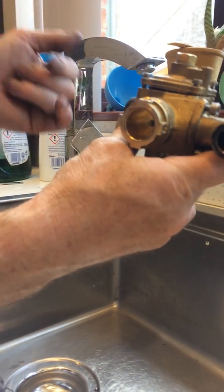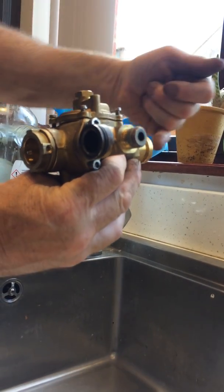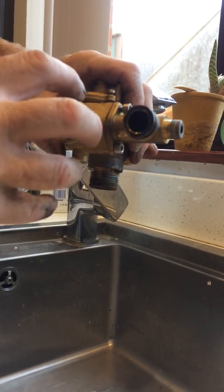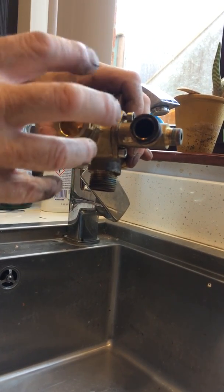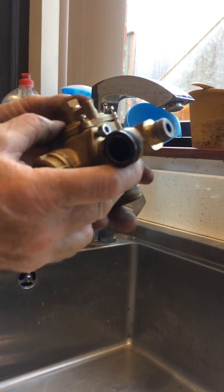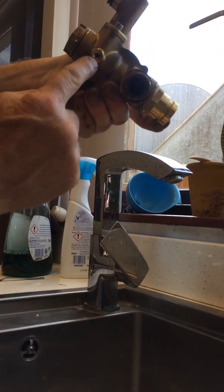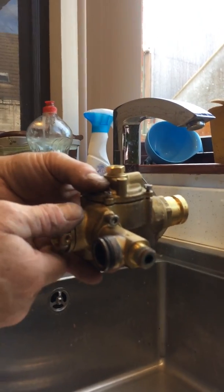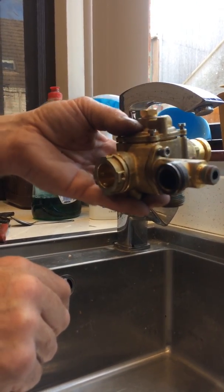The flow pipe from the water goes in here; I think this is the bypass pipe into the rear section — it just pulls out and a clip goes over it. Your differential valve goes on the front of this. I also replaced the diaphragm washer inside the differential valve, which is part of the fixing kit you can get. The central heating flow pipe goes onto the bottom, and there's a screw underneath to hold it to the boiler. That's how you assemble and reassemble a three-way valve for a Baxi 105 HE. Thanks for watching.